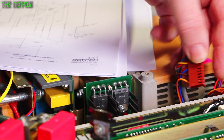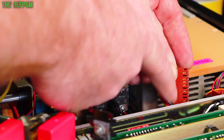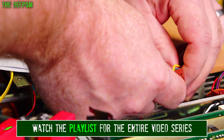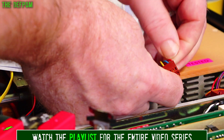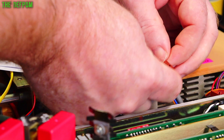So here's the cable guys in J3. Let's notice this - look. I was just going to go and test the connections. See the end pin there? The pin's actually pulling out. It may not have actually been making a connection. It's pulled really tight. It's actually not pushed into the housing like it should be. It's sticking out the back a little bit. See, there it is. That could be a problem.